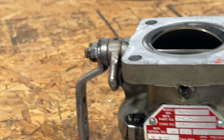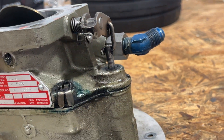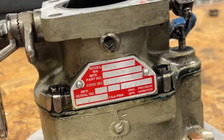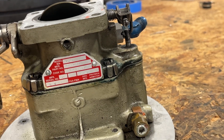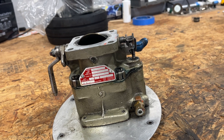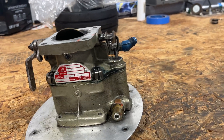We're going to replace those spark plugs, but more importantly I decided to take a closer look at the carburetor and see what was going on. Sure enough — and this is in my book, for those of you who already have the book, you'll see this — you can see this carburetor is actually leaking all around the top seam. That's very much indicative, most likely, of a very high float level. Either the float's gotten heavy and it's leaking around the seam, causing the over-rich condition. You've got a couple of options: you can send the carburetor off for overhaul, or you can just get an overhauled carburetor from Aircraft Spruce. Since this customer came from so far away, that's exactly what we're doing — had one overnighted.